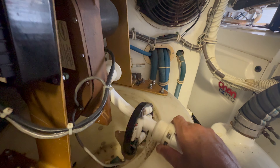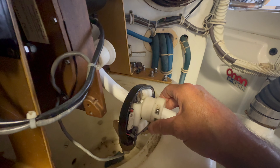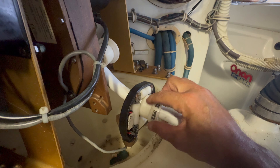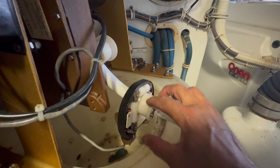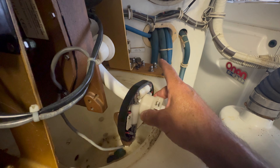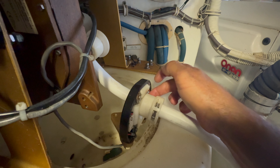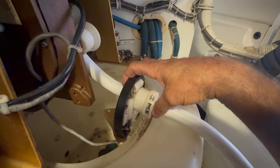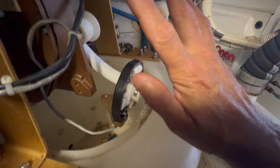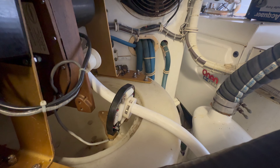Now that I have my cable stop installed — slid on — you can actually see that it goes into these rollers and what it does is expand them. When it expands, it opens up these two switches on the other side. If one switch gets activated, it still works until both sides get activated. This slides in between both of them and that's what stops the cable from going out. Make sure that this is in the right direction.